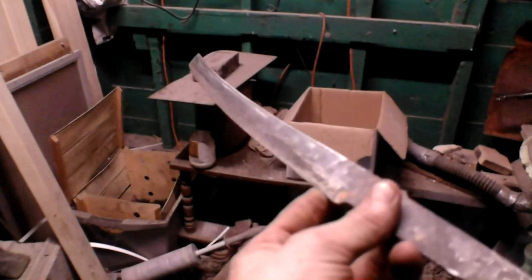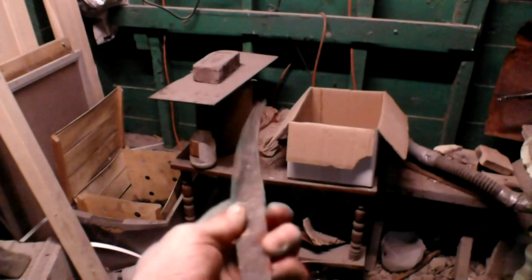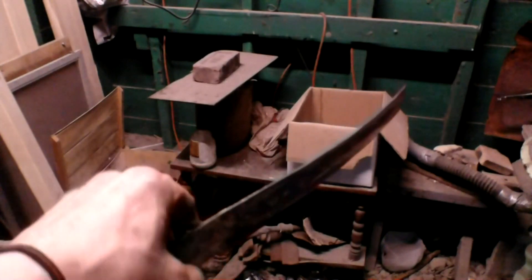It also curved. I can't remember who said 'will it curve,' and I said probably not because it's one uniform piece of steel — but it did curve and it warped like crazy when I quenched it. I desperately went over and straightened it. First I put it in the fire and relaxed it, and I could watch the whole thing literally almost straighten back out in the fire. Then I had to straighten it the rest of the way with wood, but I couldn't see well, and it's just a little bit wavy. I'm still confident it will perform. I can't believe it didn't just banana. The spine is pretty straight but the blade kind of goes wavy. I had no choice anyway, because my quench bucket of oil isn't deep enough.